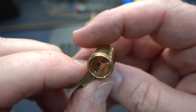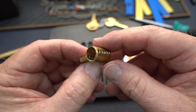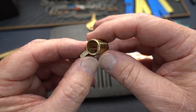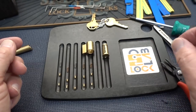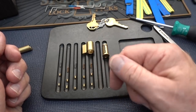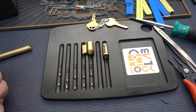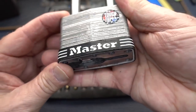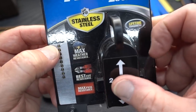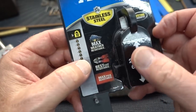So I thought there would be a lot of really unusual stuff inside of here based on the way this is acting. I think probably the spring tension is stronger in the clockwise direction than counterclockwise, which let me get a little bit better feel and control of the tensioning when picking. But I've got to say — a few serrations in here, and you Master Lock guys, you throw in a couple of serrated pins from the American padlock production line, and you have got a beast of a lock. Model 15 with Bill Clegg's modifications — with normal pins it's probably about a three at best, but for sure it's a 10 with Bill Clegg's mods.